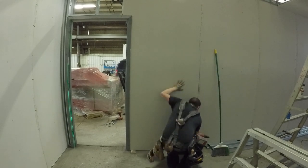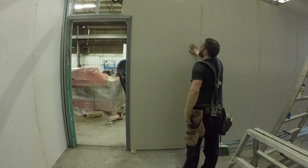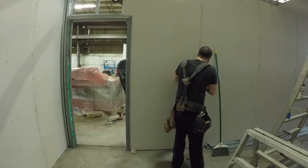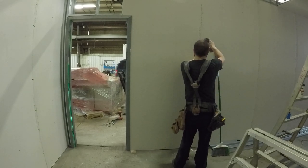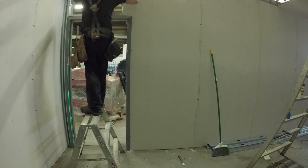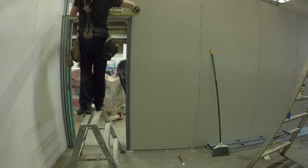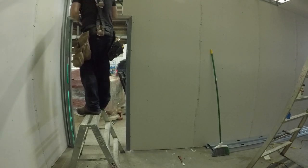If you're having issues with your pieces getting in the frames, 45 the back corners as well. I actually built these frames so the width is perfect on a 3 and 5 eighths wall with 5 eighths drywall. So if it's less than 16 inches to hook into the door frame, do a hook piece. But if it's more than 16 inches, cut a buck in. Measuring for the top piece over is going to be tight — you're going to maybe leave it a little bit short so you're not fighting to get it in.